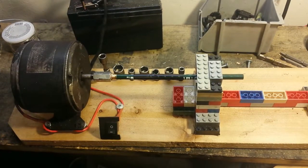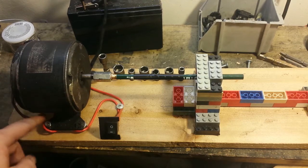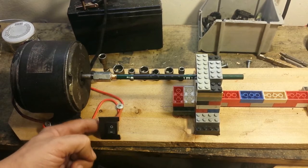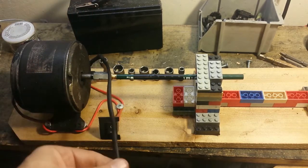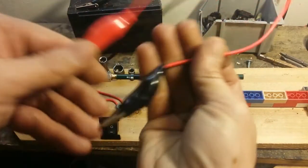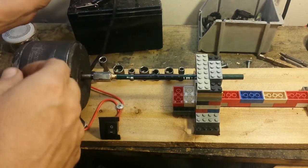So we have the electrical all wired up now. I just put a switch here, and the positive down, hid it under here, under these spacers. Ran it up to the back of the switch, ran the switch out. Goes up to a positive lead. And then took the negative and ported that out, and used some heat shrink tubing down here. Put some nice connectors on the ends. We can hook it up to the battery.